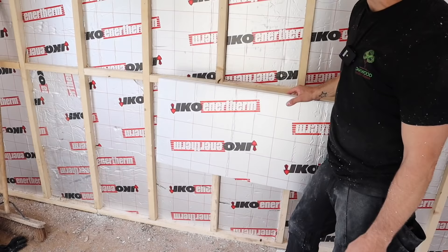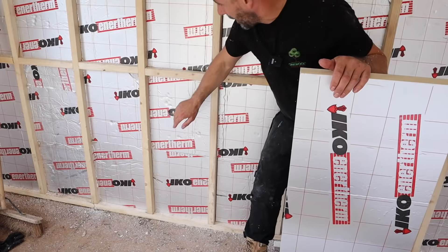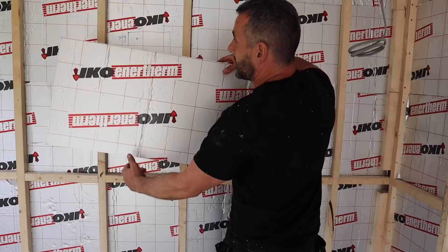If you cut them and put two bits in, cut down at the bottom — you get two full bits which is 900mm. All those noggins are 900. We put two cavity bats cut on their side, the noggins got in on top, and then we infilled the rest. That's the easiest way — cut it on its side rather than leaving a crappy little offcut.